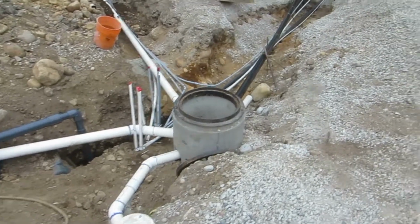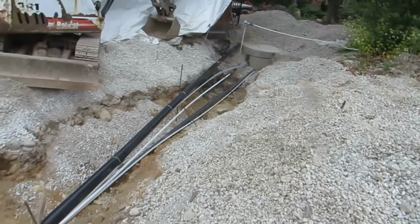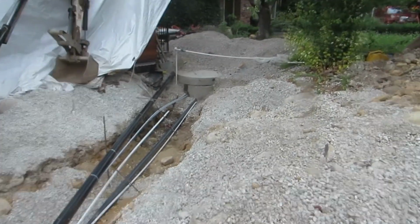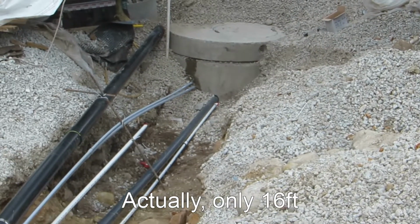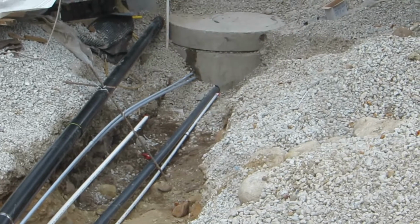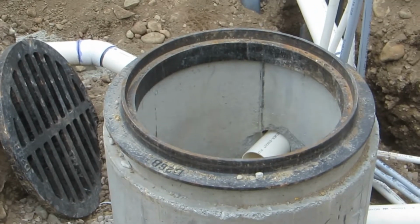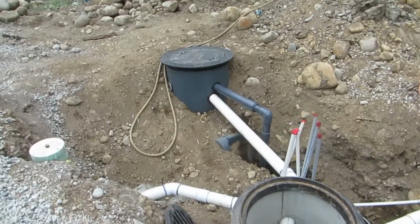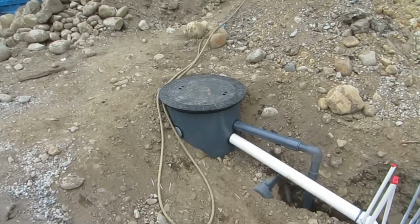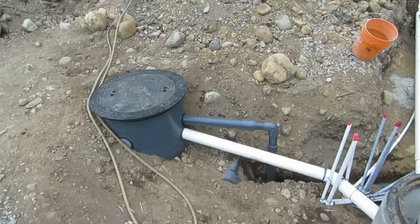And so in our case, because we are so much lower than the stormwater sewer line, which most of the houses in the neighborhood are, we have a deep well over there that goes down approximately 17 and a half feet. And then that would typically get pumped up into the shallow sump that is here before being gravity fed to the district sewer. We instead are going to pump it up into a 1,000-gallon cistern, where we will be able to keep water for use for all the exterior irrigation during the summer months when we typically have water restrictions.